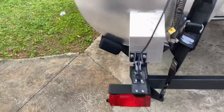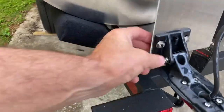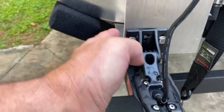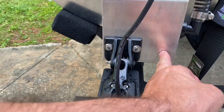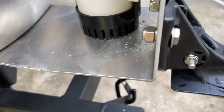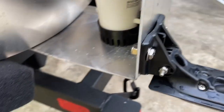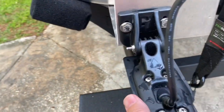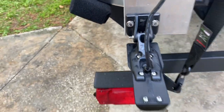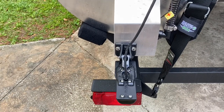We're back. I went ahead and drilled out the holes for the transducer. I mounted it on the left-hand side so that I have enough room for something else here if I need it. Just drilled it out and put in a couple of stainless steel screws to hold it on. I've got it even, got it flush. When we go out Sunday, we'll make sure that it's working correctly.